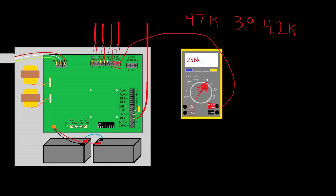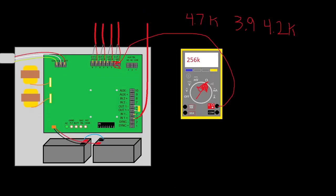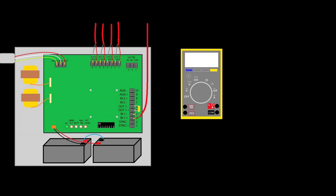Depending on the type of building, maybe you can follow the conduit or see the wire. Most of the time you're not going to know — it'll go up some conduit into a junction box and you won't know what area of the building it covers. Hopefully they labeled the wires, but if it's an older install, there's a good chance they didn't. So you'll start opening junction boxes or taking off horn strobes that have junction boxes behind them. A basic way to troubleshoot an open circuit: let's say we went back and reconnected this circuit. Instead of disconnecting for resistance, we landed it back and now we have three volts.